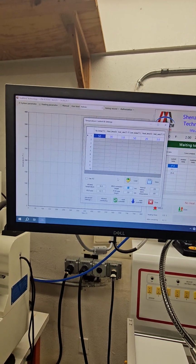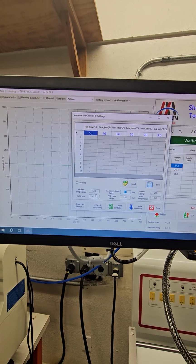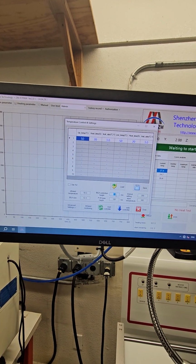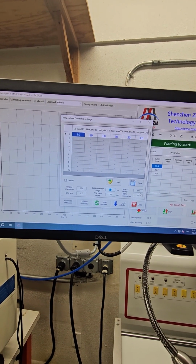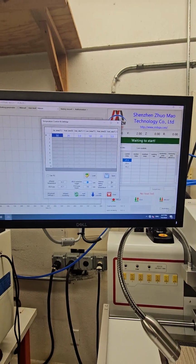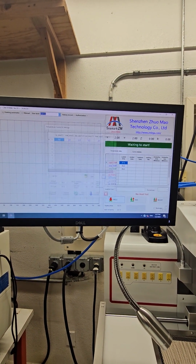Okay. So our no heat test profile, we have the infrared temperature set at 50. Our BGA size is 42.5. Our height is 180, or 11, and our depth of the board is 180. We're not really using any heat or time on this, so I just have 200, 300 set for those times. Gonna close it.